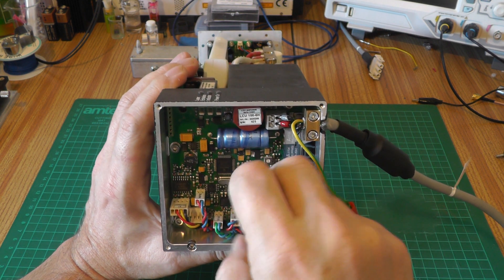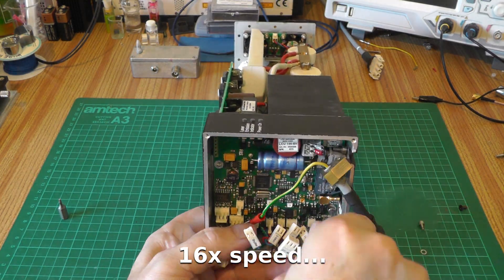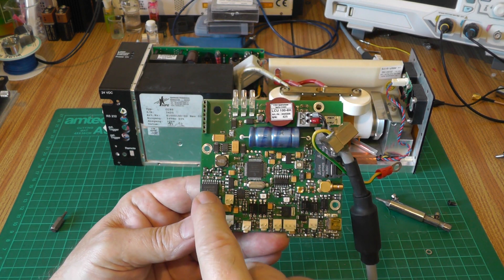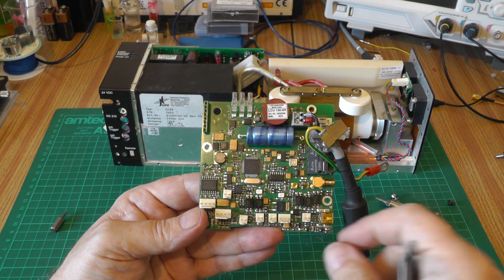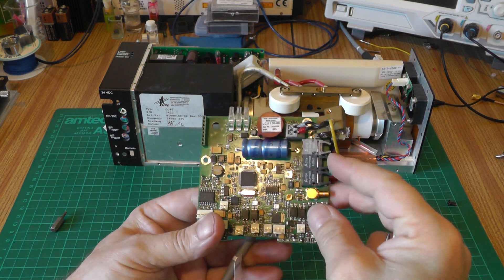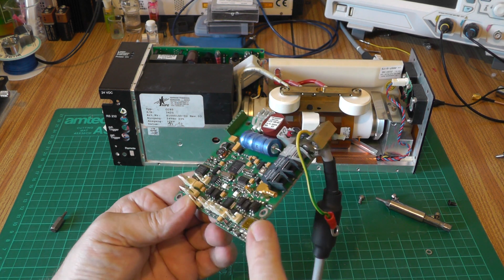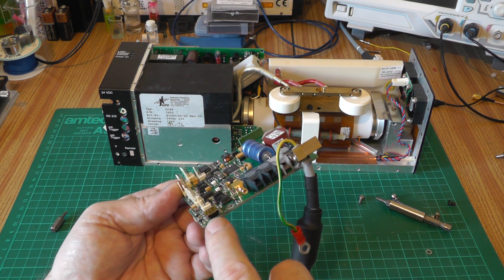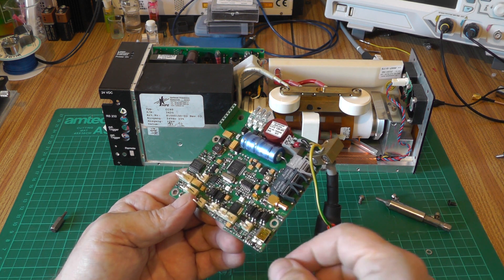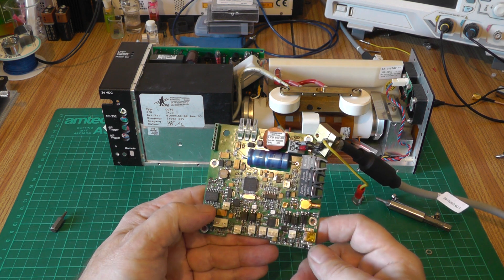Let's unplug all of the little plugs and see if we can get this PCB out. So yeah, this is all surface mount stuff — we've got a little PIC microcontroller, and this is a motor controller, because some of the versions have a rotating attenuator. We've got some little simplex fiber optic connectors on the side: the top two are for serial, and the bottom is for the trigger — there's an external electronic trigger input. And then there's what looks like a USB socket — in fact it is, one of the old style mini USBs. This is actually an interlock: you short two pins together and then you can turn on the laser. Unfortunately, the magic smoke started whispering out from the bottom here, and it's a fairly dead board.